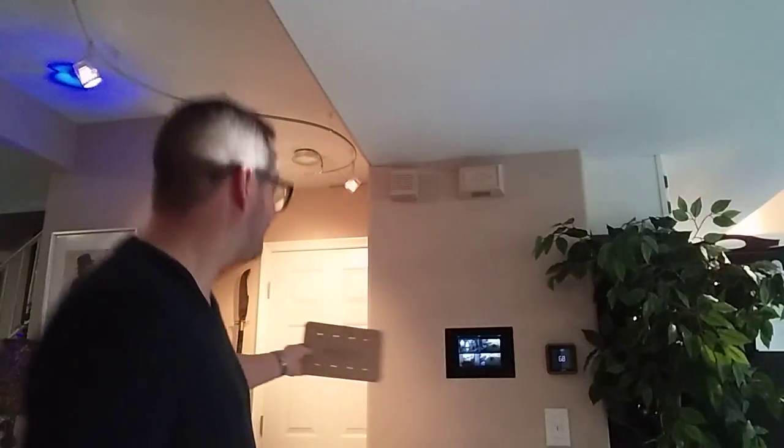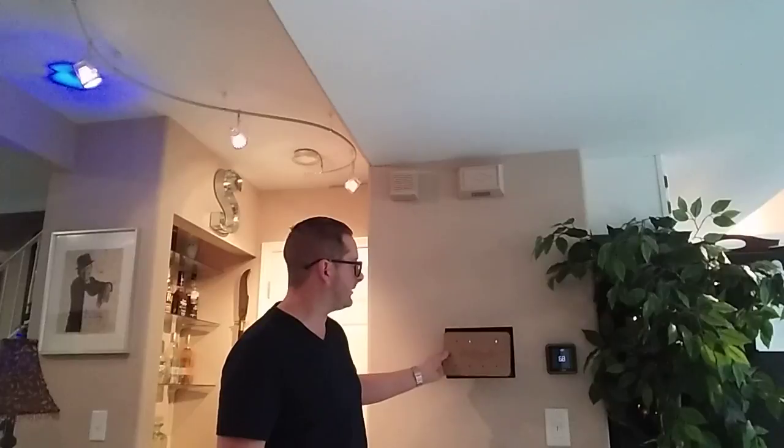I'll be coming back to this device at a later date. I really wanted to show you me cutting out the sheetrock, but the video got corrupted — don't let that scare you, it's really easy. As shown with the template, you just put it where you want it, measure, find your center, trace it with a pen, and begin cutting. Just be careful not to go too deep as there are wires inside the wall. If you don't feel comfortable, have a professional do it.